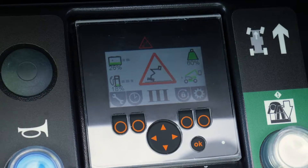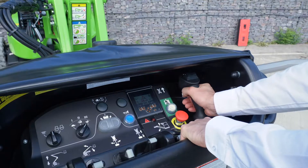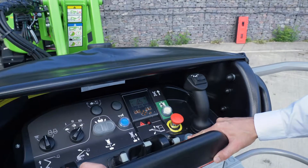If there was an attempt to elevate the booms while on a slope outside the allowable limits, an audible and visual alarm would sound. At all times while the audible and visual alarms are present, the drive function is disabled.